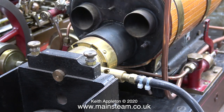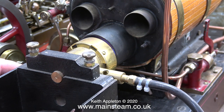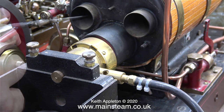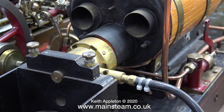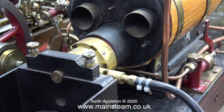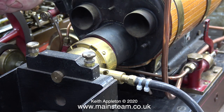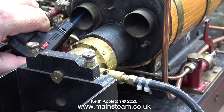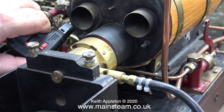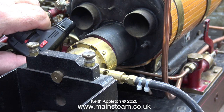In this clip I'm illustrating the principle, hopefully without burning my fingers. Even though I've turned down the gas pressure, there's a lot of heat coming out of these two tubes above the main center flue and exiting the center flue. Inside the other end of the boiler there is a great deal more heat. As I mentioned earlier, in the design of this boiler there are two return tubes, but sometimes there are multiple fire tubes. To illustrate the fact that both the heat and the products of combustion are returning down these tubes, when I hold my small blowtorch in front of these flues the flame is extinguished and I can't light it in this position.